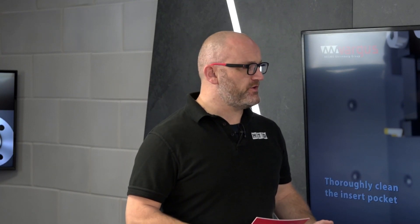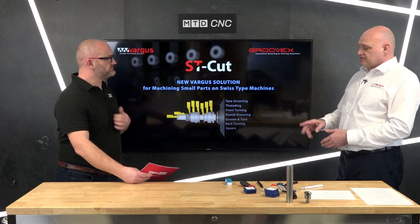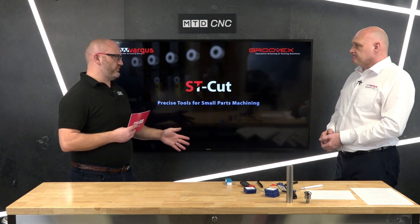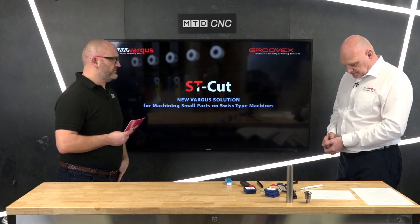Where are we in terms of holder sizes, and I know you've got some good carbide grades also? We have two grades: a VPG coated and a VS020 uncoated. We've found with the testing done in the marketplace that those two grades cover all materials. And we're not just talking about straightforward grooving here — there are lots of applications for these tools.